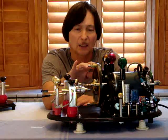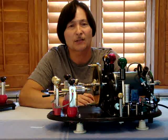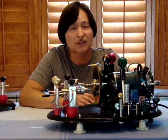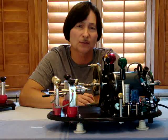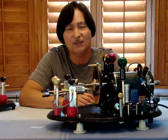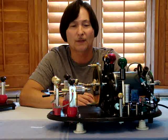This whole unit had a lot of meticulous machining done to it for accuracy and performance. There's a lot of precision involved here, and balancing is a key issue on rotary spark gaps, especially since this motor is spinning at 3,400 RPM. You want to make sure you have good balancing — very, very important — and that was very well accomplished.